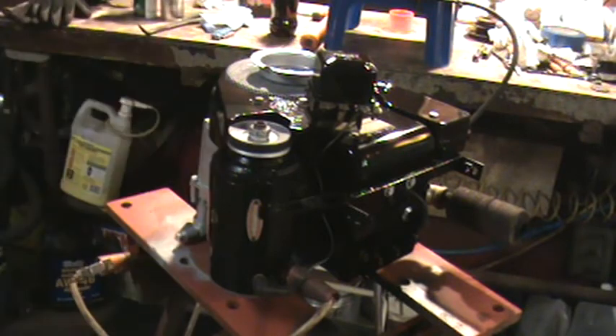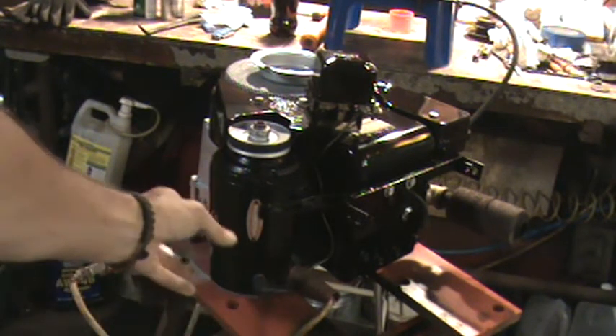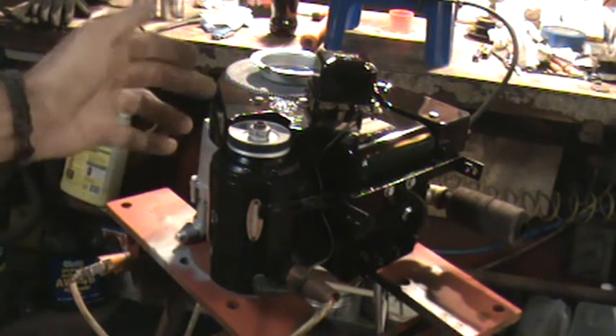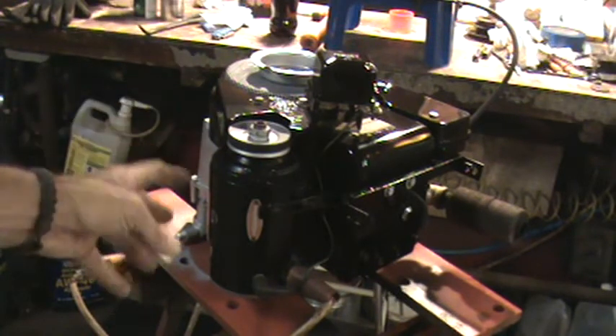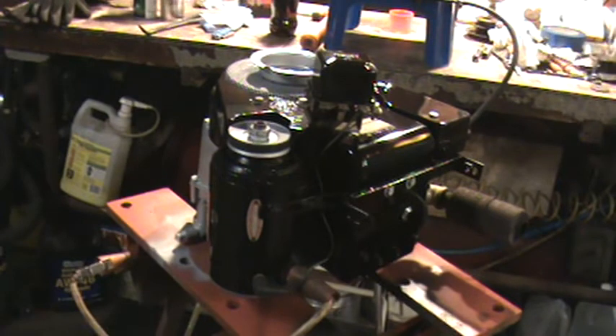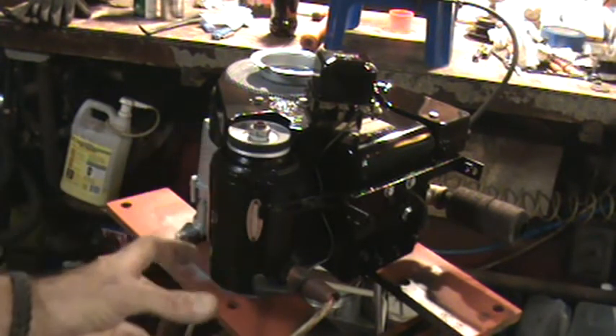Figure an engine that's 39 years old — if this is the original starter generator, I'm surprised it lasted this long without any maintenance done to it. So I'll probably show you guys what I do when I change the tail cap. As long as I don't pull the armature out from the housing, I won't have to pull it away from the brushes.